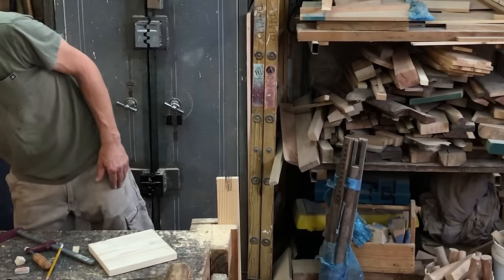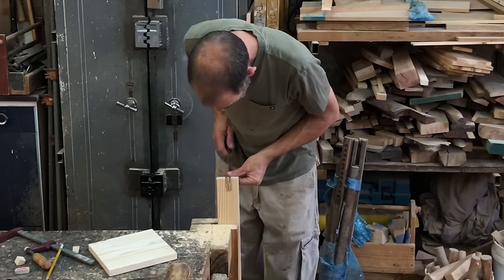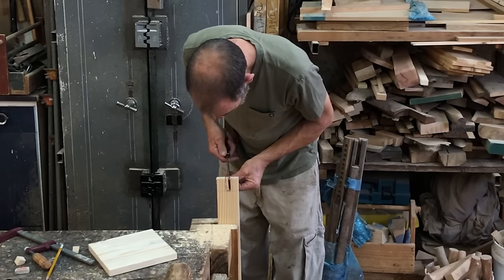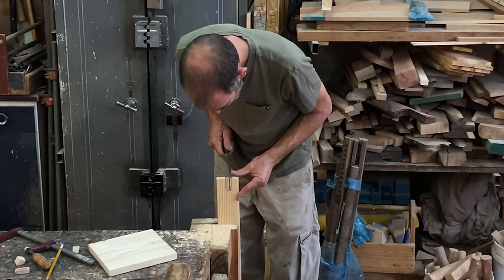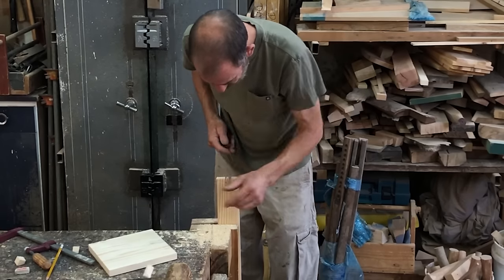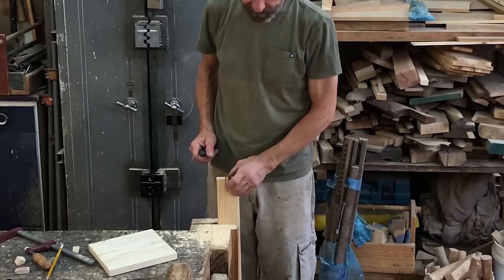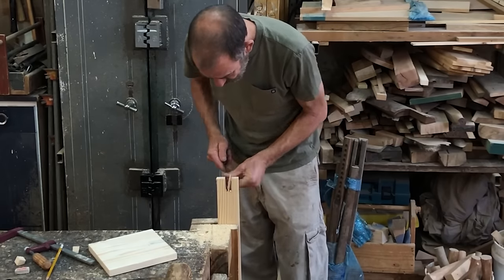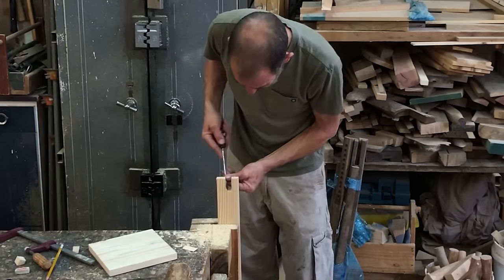Okay, so if you make a series of saw cuts close to one another, and then with a screwdriver, you should be able to just snap off this material. Now I know we're with the grain, it's not ideal. This is not a technique. This is for someone who doesn't have a narrow enough chisel. There we go. Torn all those off.